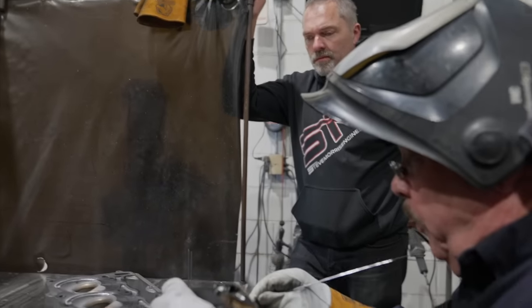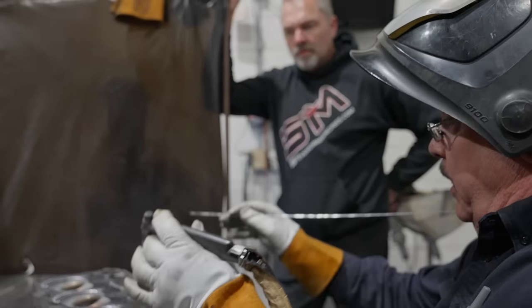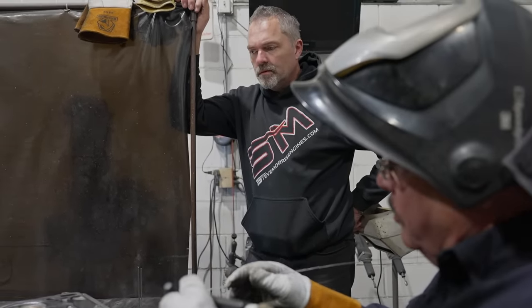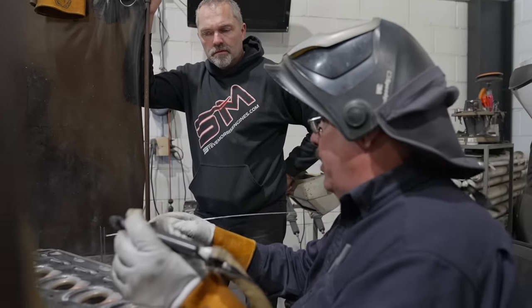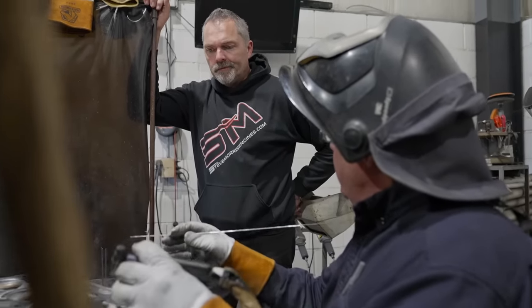When you pull that thing up, you spread the heat cone like this. It just opens the heat. What you're trying to heat is this whole area, called the long arc. You get that too far away, it's a long arc. That's why you weld that at 180 amps, because all those amps are going right in there. You're not wasting anything.